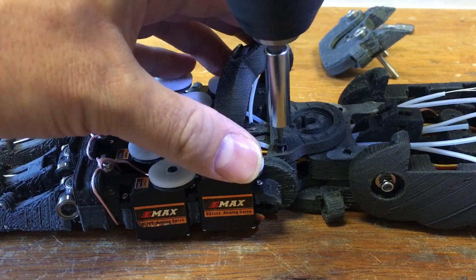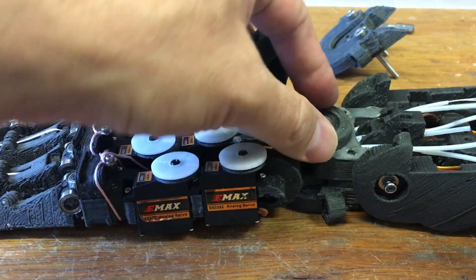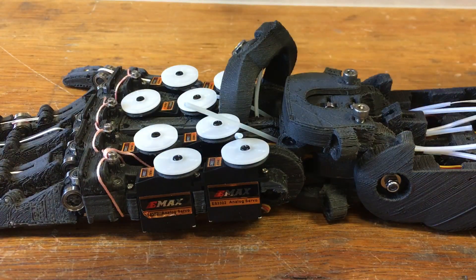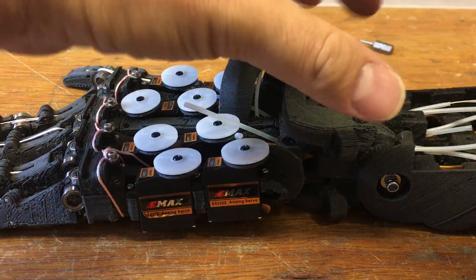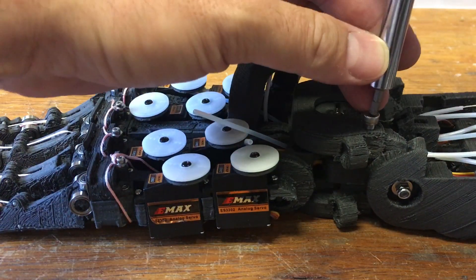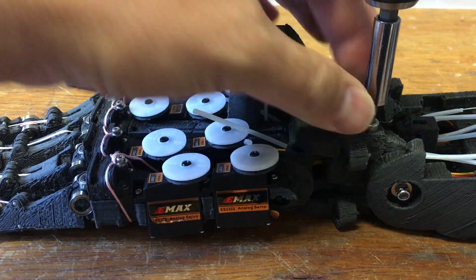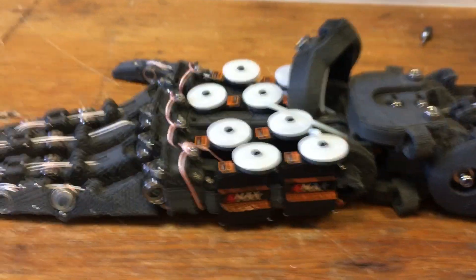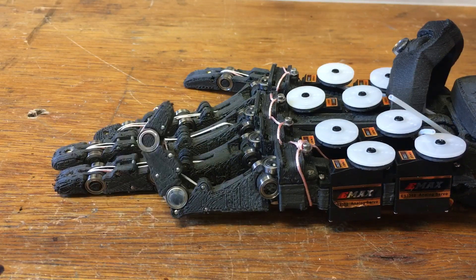The wrist is held together by those screws — those are M3, these are M4. Not too tight, frankly; it's metal against plastic. Just like four of these pieces. And then we do a quick tendon test to make sure the fingers are still moving freely.